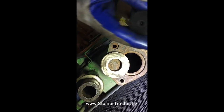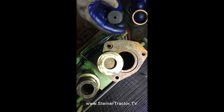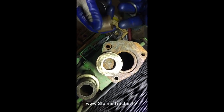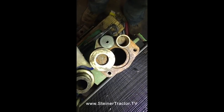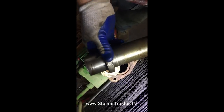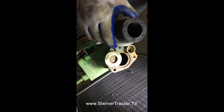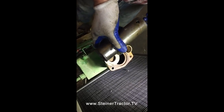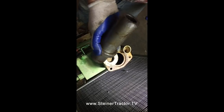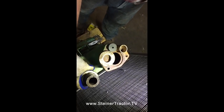And thread it all the way and pull the bushing up from the bottom into the bore would be another method. But we're going to challenge ourselves to see if we're able to drive the bushing down in with the bushing driver. We found an axle sleeve off of a John Deere plow. So if you have a John Deere 44 wheel axle, we'd be able to borrow the bushing or the bearing sleeve from that to work with our driver set.